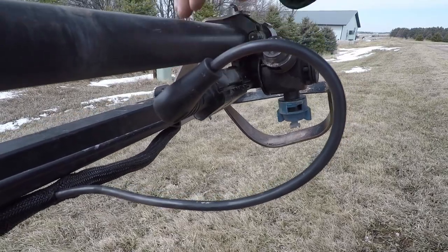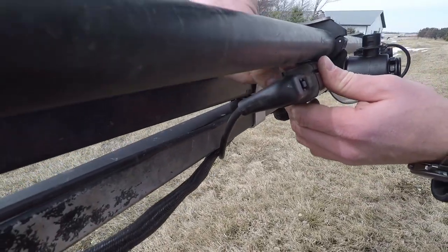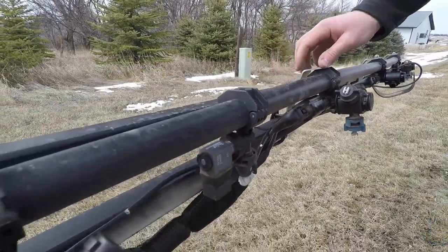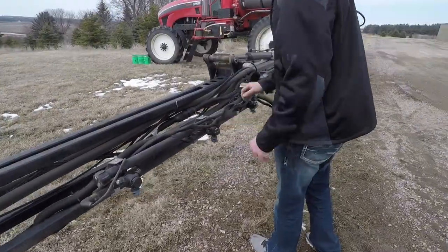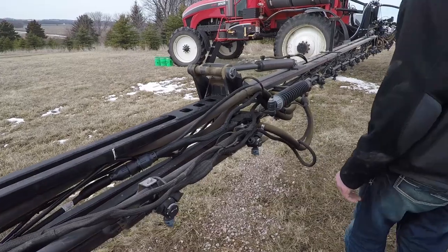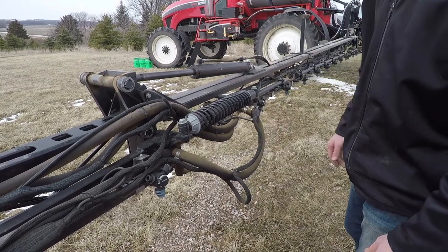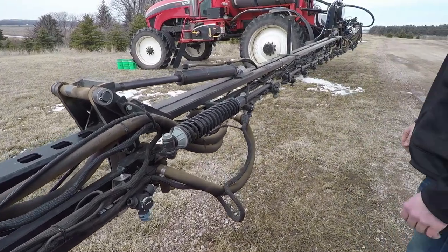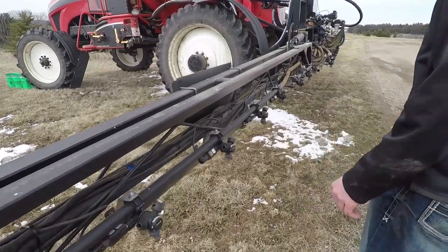Going through here, check all the NCVs and make sure they're blinking the same color. You don't necessarily need to know exactly what the nozzle LED light is doing, but at least make sure it's consistent with the rest. If one is blinking an odd color, you can address that one. Making sure all those 19-pin connectors are sealed up well - take them apart and make sure there's no corrosion or water intrusion. Mainly just make sure everything is tied up nice and neat and out of the way. This is something you'd want to do every morning when you start the machine up.